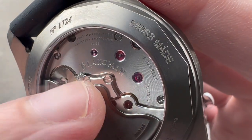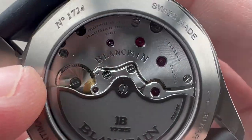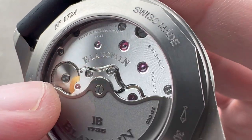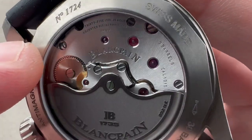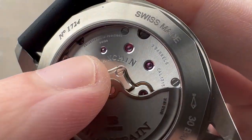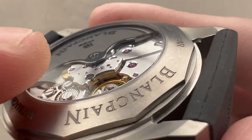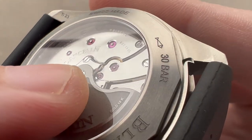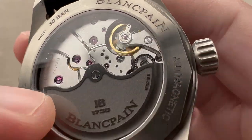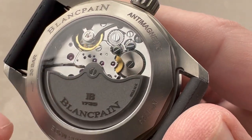You can see that the bridges feature beautiful polishing. The bevel is a mile wide. And while I know that some of this is executed mechanically, it's much more convincing than the beveling you'll find on everything from JLC to AP to Moser to FP Journe. This is very impressive for a series-produced watch, and in all likelihood a hand-buffing tool is used to finish off these mirrored bevels. You can see the same degree of beveling in the screw and jewel sinks, a lovely snailing across the bridges. You can also see where bridges are layered, such as for the winding system — bevels of both overlapping and underlying bridges have been polished. We have some engine turning on the base plate. Screw heads are black polished, and we have a combination of satination and solarization on the wheels.